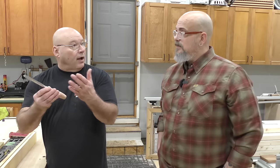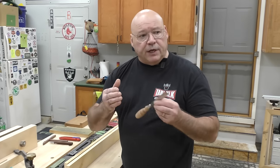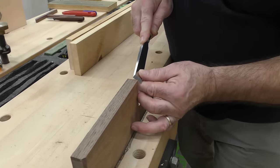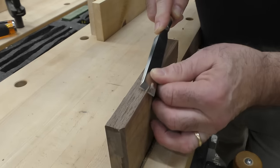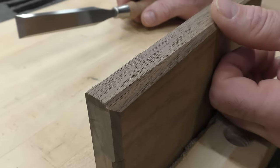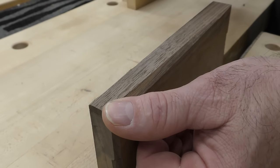I made room for these in my tool trough with my kaizen foam, because I'm always reaching for a chisel for multiple applications — some final fit and finish, and instead of going to grab a hand plane, I can just do a quick chamfer. You'll see how easy it is. When you do something like that little chamfer, feel that Big D — feel how smooth it is. Like glass, right? That is a wicked sharp chisel.